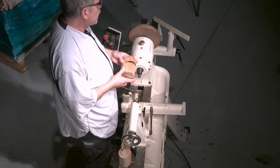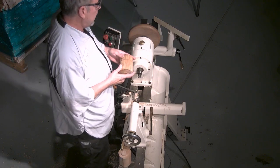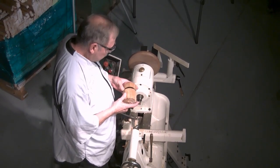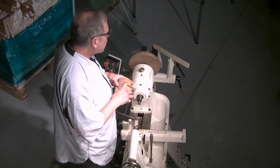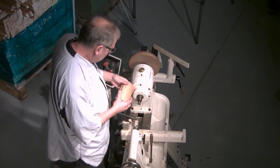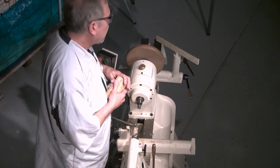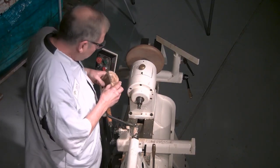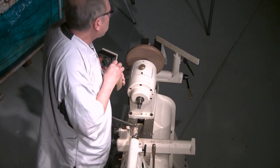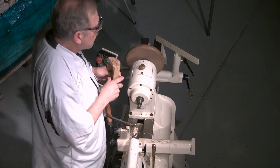When we part this thing off and put a tenon on it, I'm going to lose an average of 3/8 of an inch, right here. So when I choose that spot, I want to choose the spot where the grain is the straightest. I realize you guys don't have a lot of light, but I'll pass this around. If you pull your phone out, you'll see how those fibers tore on this tenon, just like I explained earlier.